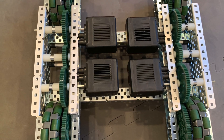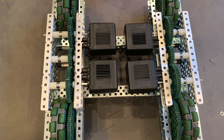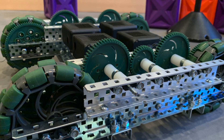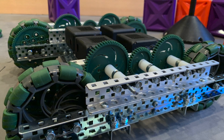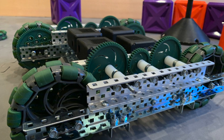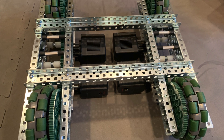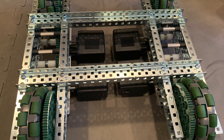This is a directly geared drivetrain. It's composed of two 200 RPM motors geared 5 to 3, connected in the middle to transfer the torque to both wheels. The drivetrain is 25 holes wide, which is the same width as Pippin. We decided to build the drivetrain out of steel to try and lower our center of mass as much as possible. This is about as thin as you can possibly build a four motor drivetrain aside from building some right angle gearboxes or stacking the motors vertically.